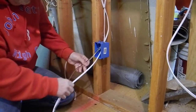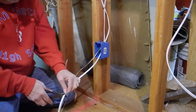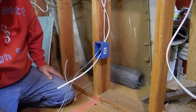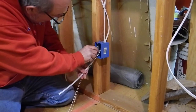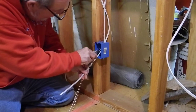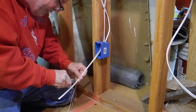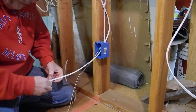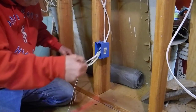This is kind of ridiculously long, so I'm going to cut this here. It always makes sense to pull them long because you can always cut it off, but you can't add more. I've seen electricians go all the way through so the knife proceeds out the other side — you've got to be careful, you can cut through your insulation doing that.